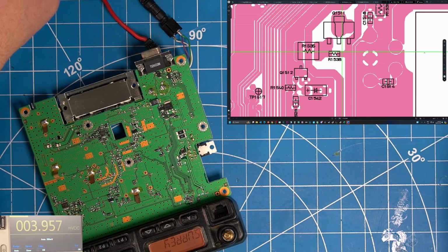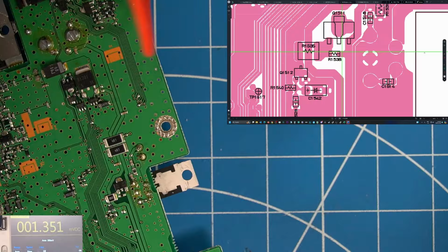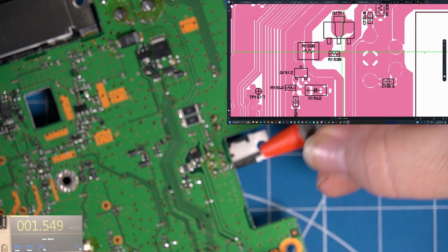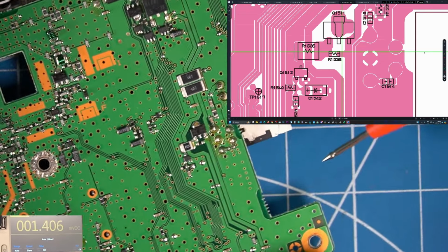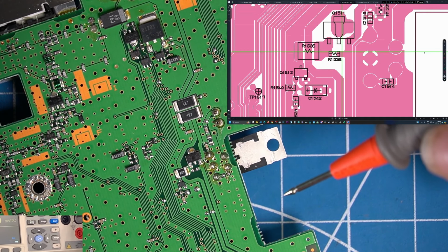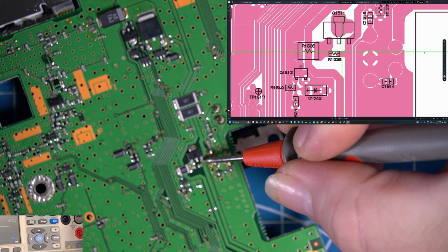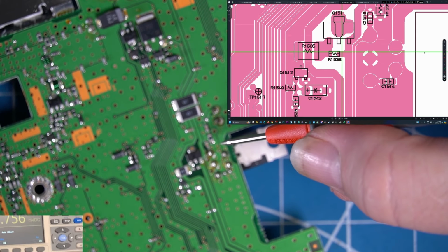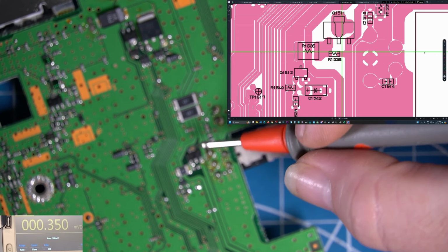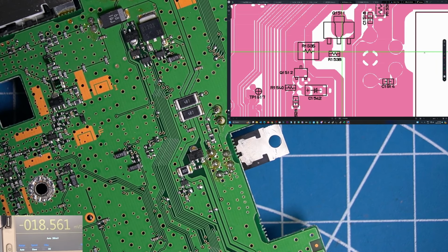at Q1511 to start with. That main trunk there, this one here, it's gonna focus on me. What? Don't focus on me. This main line here should be 13.8 volts. Let's find a good ground. Okay. Perfect. Well, you can't see. I gotta get this thing working again. It's 13.9. Perfect. Well, you know, we knew we had that.